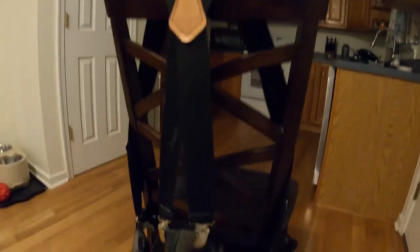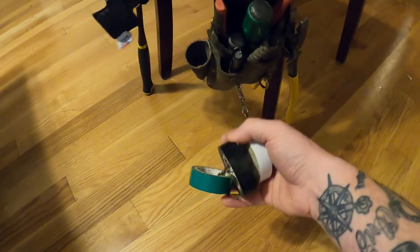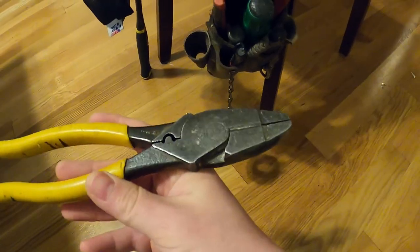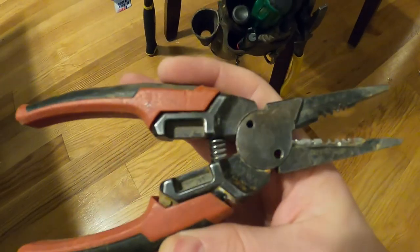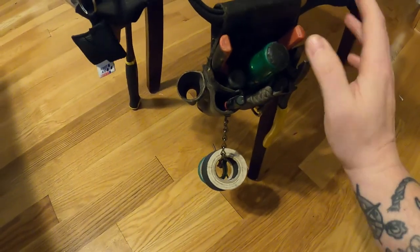Let me show you my rig. This is what I used for years and years — just a harness with a belt, one of the best tool holders I found for electrical work. You will need electrical tape; the three most important colors are green, black, and white. You'll need a pair of nine-inch angle pliers — cut pliers with crimpers built in the back side, we always call them Kleins, though you don't have to get that brand. You'll also need a pair of strippers. You can't be stripping wires with your pliers because you'll nick the wire and eventually over time it'll be an issue.